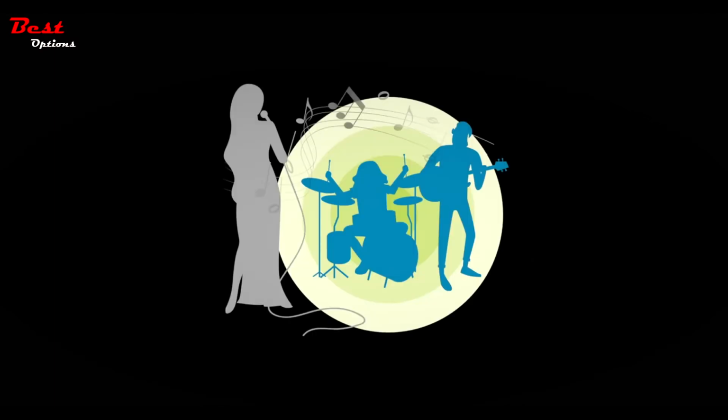So PM bass or phase matching bass, what does it actually do? The best way to think of it is like an intelligent loudness control, and we all know that loudness controls tend to be used at low volumes to help fill out the sound. Now the major drawback with using a loudness control is that you get a phase shift in the low frequencies, and these problems can occur even up to 300 hertz, and this in turn is detrimental to one of the most important areas, which is the vocals, and essentially everything becomes blurry and muddy with a lack of detail.